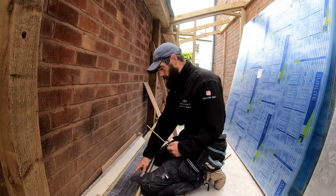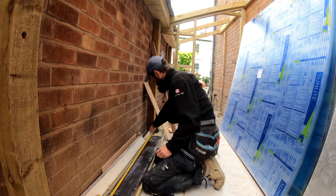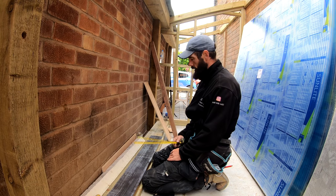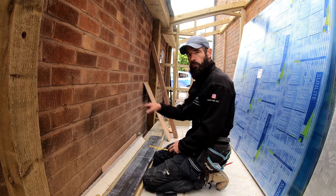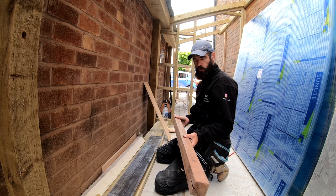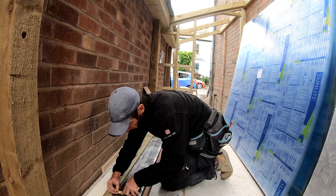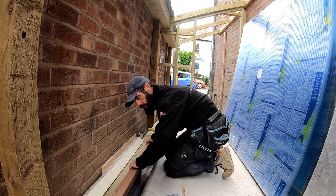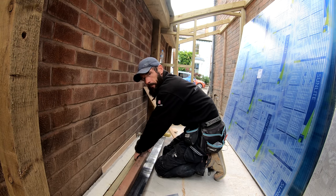The first thing we do is cut our lead at 1.2 — and remember, no more than 1.5. So this first piece of lead that I've cut is at 1.2. We're using code 4 for this because it's only a cover flashing and that's all you're going to need. So first we want to put a 1 inch going into the brickwork. Then I have this lead bending stick — just a bit of solid timber left on site with all the sides cut on it. Mark on the 15, get my lead bending stick. There we go — scribed a line. Now we want to bend this up from the middle.